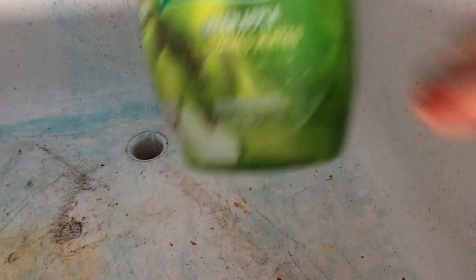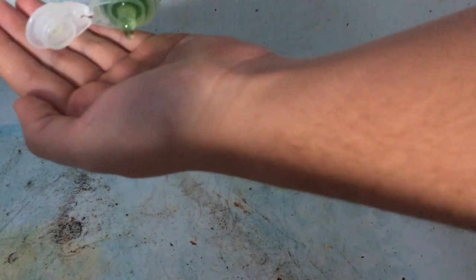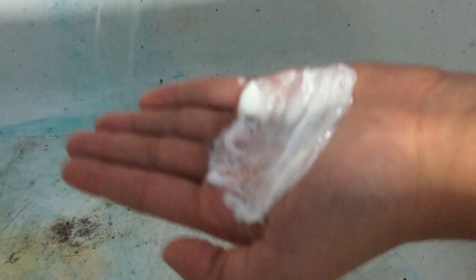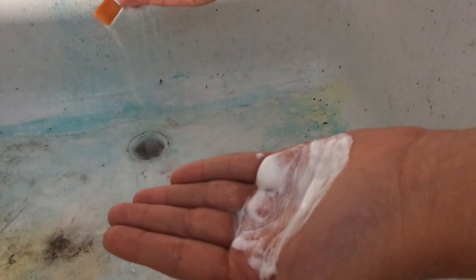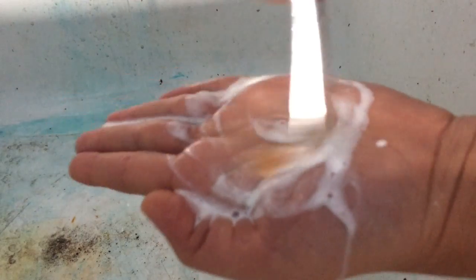Once you're all done, you will need to wash your paintbrush. You wash it the same way you would wash any other paintbrush. Go to a sink that you don't use for food, or an old sink you don't really use, because the paint or varnish will stick to it and color it — as you can see, my sink is pretty colorful. Make hot water run and run your paintbrush through it. Then take liquid hand soap or dish soap, pour a little in your hand, and make circular motions with your paintbrush. After a few seconds, run your paintbrush through water again, and if it's not completely clean, take more soap and clean it again.